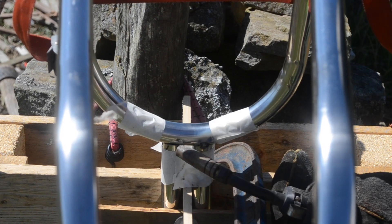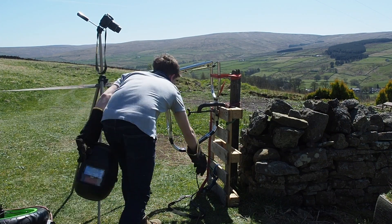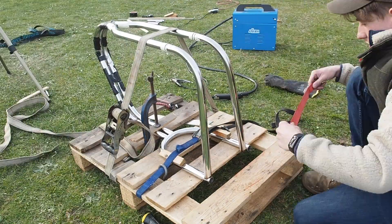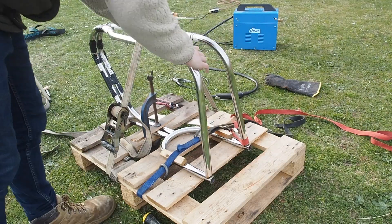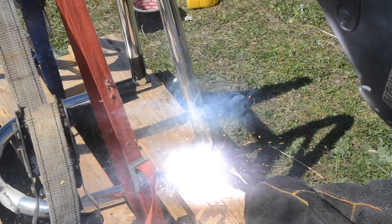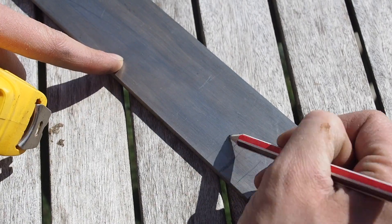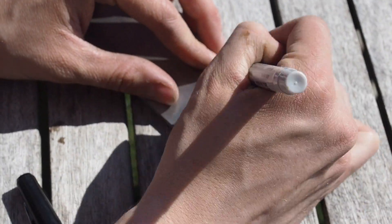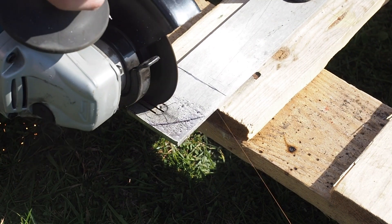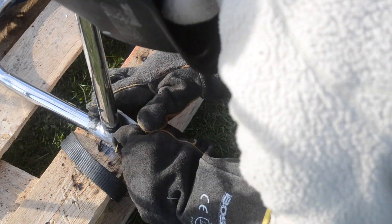I've secured it in place and put a few spot welds there, then welded it all up. I'm strapping the frame down to align the tubes to the U-bend, and they are ready to be welded up. I've got some more flat bar here — 50mm wide — which will be used to take the fitting from the wheel to be bolted to the frame. I'm cutting out the section where the shaft from the wheel will slot in and welding them to the frame as well.